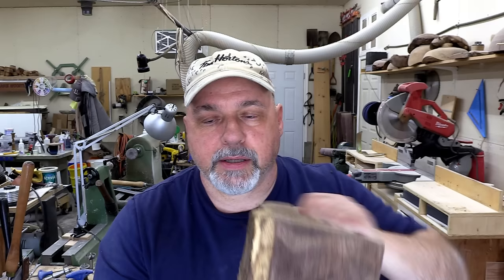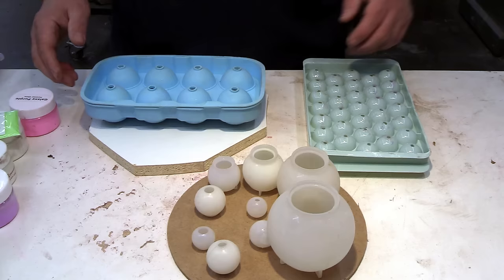This week we're going to be working with some beautiful black walnut — can never go wrong with black walnut. I've got two of these and I want to put them natural edge together. What I want to put between them are glow-in-the-dark globes. The first thing we need to do is pour the globes so we can get those in the pressure pot, and then we'll clean up these pieces and get them ready for casting.